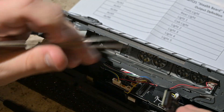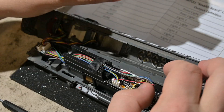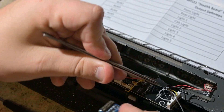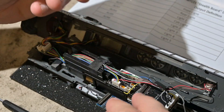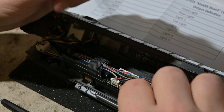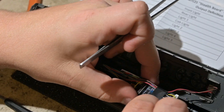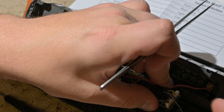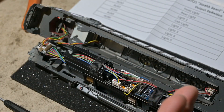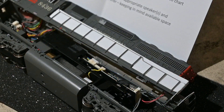We're going to take our 21-pin decoder. The photo in the manual is a little different on showing you how to do it, but I'm going to finagle this and just let the wiring kind of chill either on top or to the side. I'm mainly concerned about getting the 21-pin plugged in — we're just going to make life easy, reroute a few of these wires out of the way and reapply some tape. As far as that's concerned, we are good to go on the decoder. You can do this for a LokPilot, LokSound — if you want to go Tsunami you have the option. ESU should be pretty plug-and-chug on this locomotive. The decoder is in — now for the fun part with the speaker.